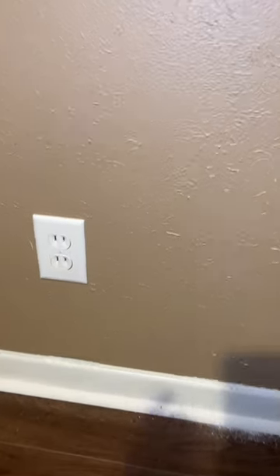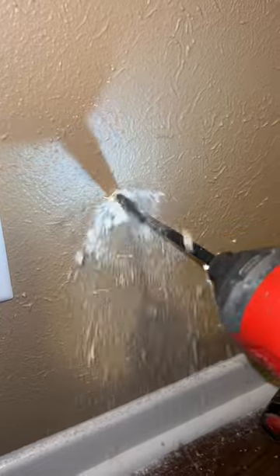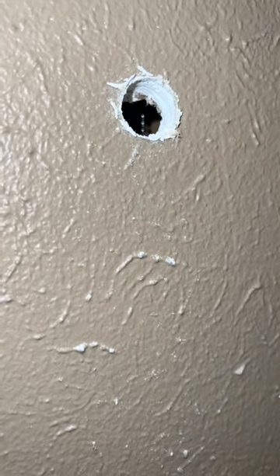We're now back in the room. We're going to go ahead and drill a three-quarter inch hole right here on the wall and see if we can retrieve that ball chain. After we're done I'm going to cut it out and put a bracket in the wall plate, but this is just for educational purposes. All right, we got our hole drilled — it's nice and perfect. I can see my ball chain right there. Let's try to retrieve it with the tool.